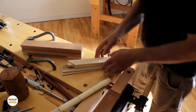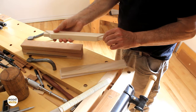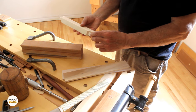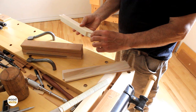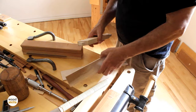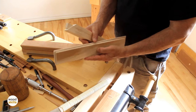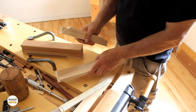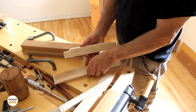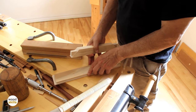I did some research and I found out why the second tenon I created is narrower than the original tenon. That's because I had used two different spacers on this tenon to offset it a little differently to have a wider tenon, and I didn't do that in this case. I used the same spacer unknowingly, so there's no problem with it. It's just a narrower tenon, but that explains how critical the spacers are to remember to use. You're creating a series of these components, so use the same spacers for each shoulder, each cheek of the tenon.